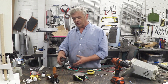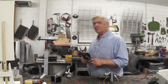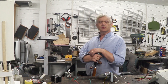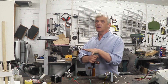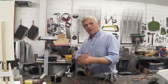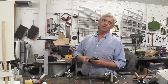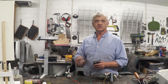The cranking bit, where you've rigged up your own generator, is going to the bit where you store it. Both the hand drill and the egg beater are, of course, a gear mechanism — you've got a big gear going to a little gear, and they'll be able to spin that faster. According to Stanford, an average human can produce something like 60 watt-hours from arm strength alone. So it's going to be some cranking, but you'll be able to charge some things up. This will only work while you're cranking it, and that's not a lot of use. What you want is to be able to store that energy, and you've got a number of options. One thing is to charge these — these are supercapacitors: 2.7 volts, 500 farad, green cap supercapacitors.